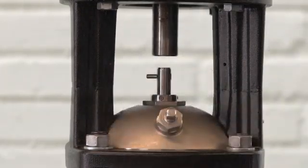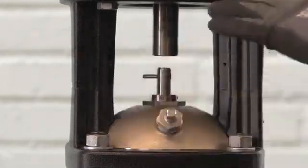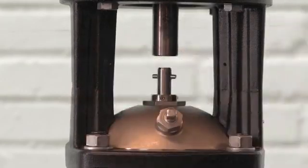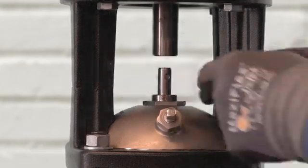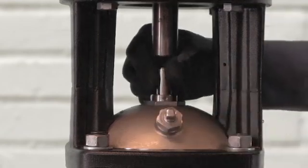On the medium CR, once you've loosened all of the screws, you want to push down on the shaft to make sure that it's all the way resting on the bottom. Once we're assured that the shaft is resting all the way on the bottom, we're going to go ahead and tighten the set screws according to the torque specifications for the pump. For this pump, that's two foot pounds or 2.5 Newton meters. Tighten the first one, rotate the shaft and the seal, tighten the second one, rotate the shaft and seal again, and tighten the third.